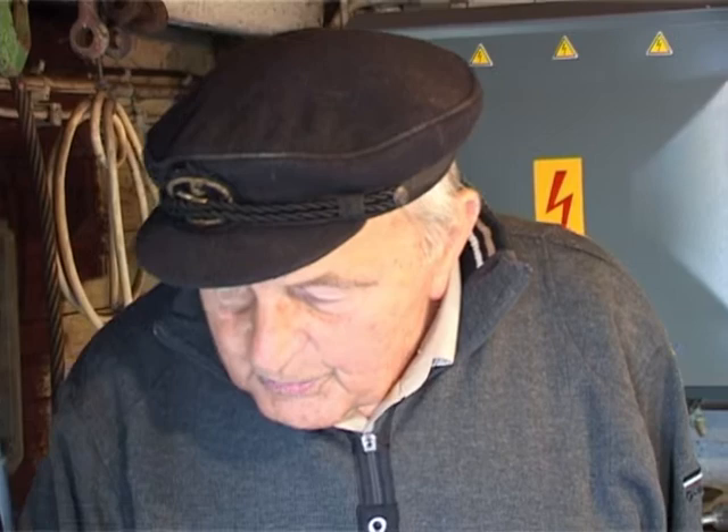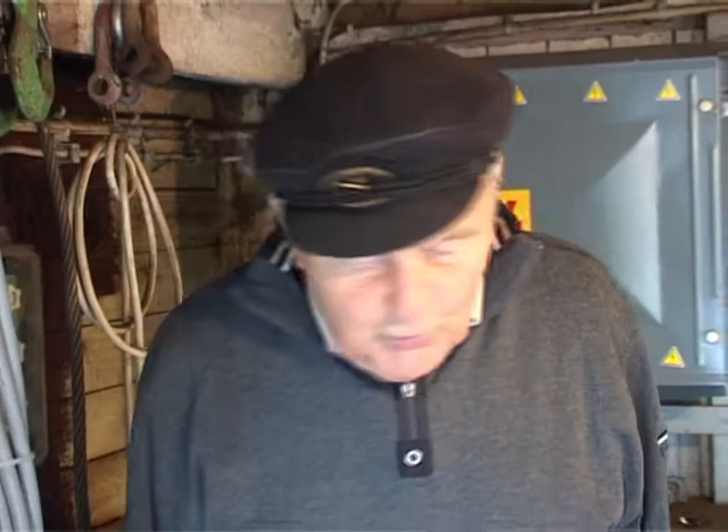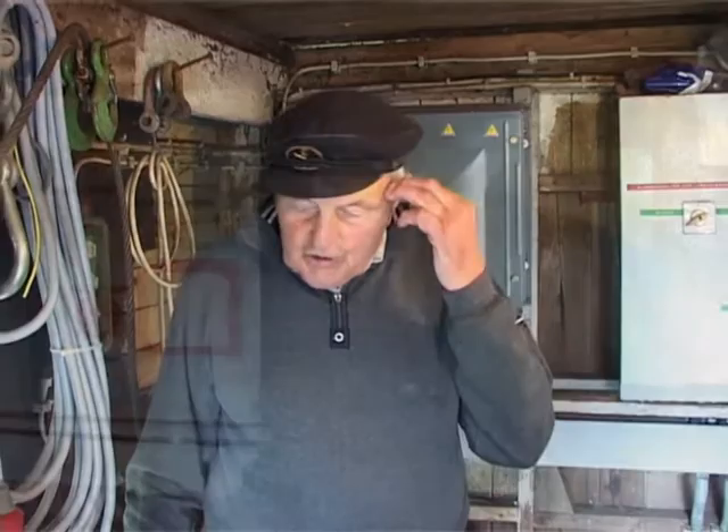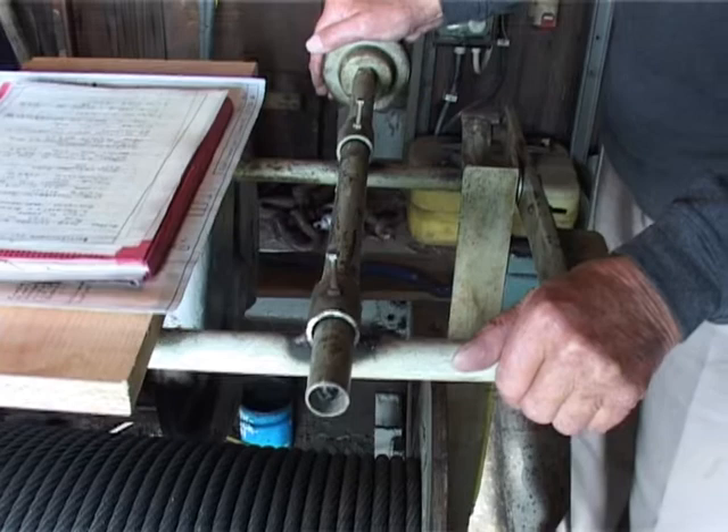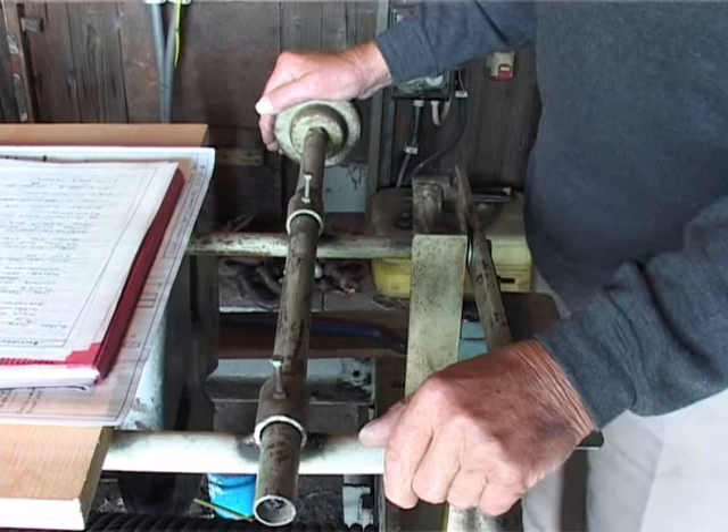The brake does not need to be removed — it must be cleaned. This maintenance work must be carried out. And if I can no longer do that myself, that is my son Lothar's job. That there is the slack wire safety device (Schlappseil-Sicherung). When the wire rope becomes loose, it gets caught, comes to the switch, and the power is immediately cut. The motor is automatically switched off. That is also very important.